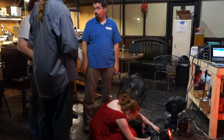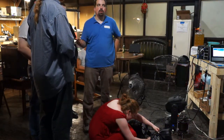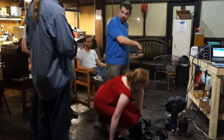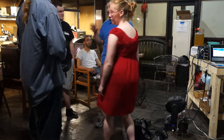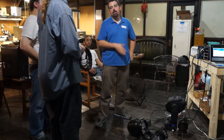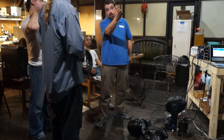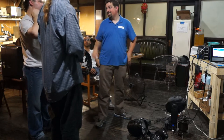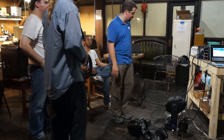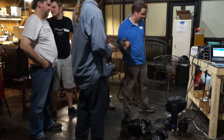Could you put that into one of the microphones or anything like that? If you plug a light into a mixer, like a sound mixer, and it was running phantom power, which is 48 volts, which is a standard, then if you did that, you would send 48 volts down, and it's only expecting 6. And you just fried your receiver circuitry, and that's it.